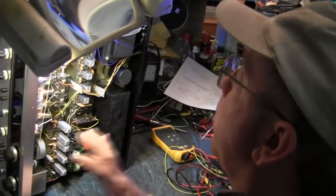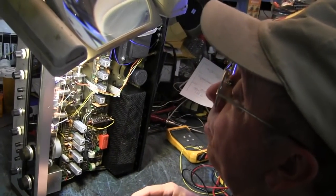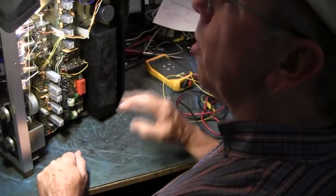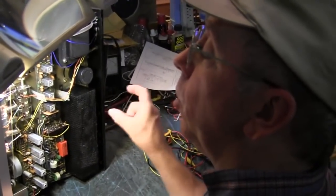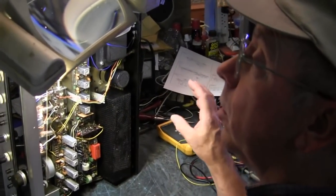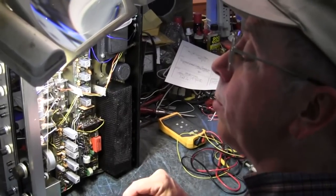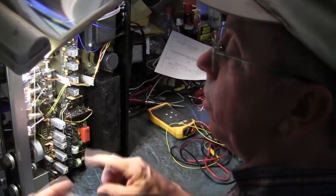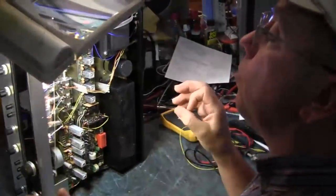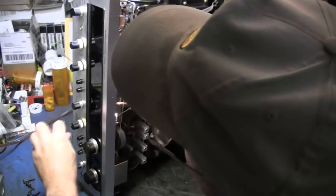A lot of circuit boards will have 100 mic capacitors across the B plus line in 100 places. In the case of that, and Panasonic's big video decks were bad about this, all the capacitors can be kind of bad, but because they're all in parallel, the ESR meter doesn't see them. You have to pull a few of them out of the circuit and test them out of the circuit. Go, okay, this capacitor is marginal, but all of them together look good. But it doesn't mean that all of them together are passing the highest frequencies to ground, which they must do to maintain gain, linearity, minimize distortion. But if you find some capacitors drying out, you can bet they're all drying out. So, yeah, this is a good evening's work.